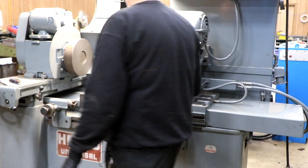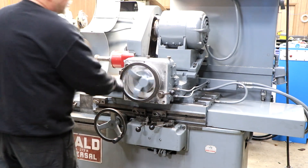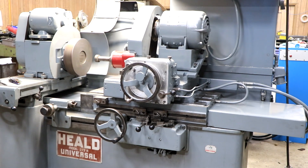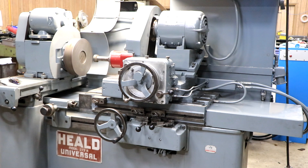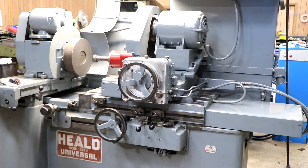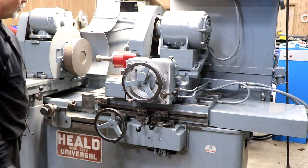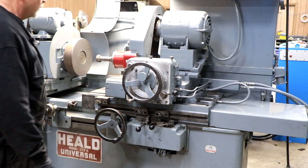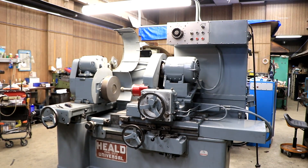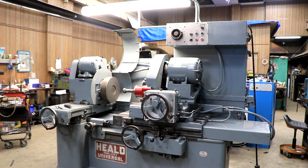This slide here is also mounted on hydrostatic ways — the whole machine is on hydrostatic ways. This table floats on a thin layer of oil. That's why it's so important that you have the right oil in it, a good filter, and that the whole system has been flushed out and cleaned out. We actually ran some mineral spirits mixed with some fresh oil through it before we put the DTE Light in. The idea is that you really don't get any wear on the ways because it's always floating. But you don't want to try to move this unless it is floating. The cross slide actually floats too, but this headstock portion is just metal to metal, scraped metal and grease — there are grease fittings in the back and you have to keep up with that.